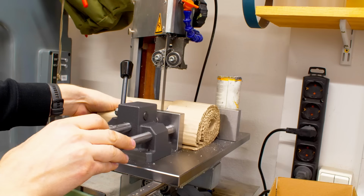On tool and cutter grinders you always get grinding dust on all the sliding surfaces. So make sure each time you move some of the accessories around on either the dovetails or T-slot table, whatever the machine is configured at, to wipe it down before you move anything, otherwise you will get a horrendous amount of wear in a very short period of time. Also, generally it's a good idea to keep machines as clean as possible. It just makes for a longer lasting experience.